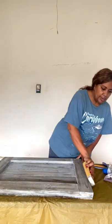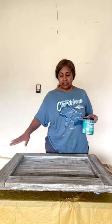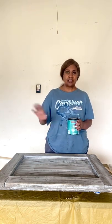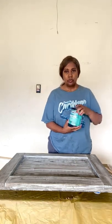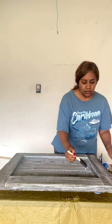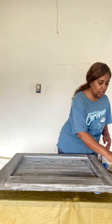The next step: you'll want to apply Minwax water-based Polycrylic to seal in all this goodness. I'll probably put about three coats on it since it is a stove board — you'll be handling it a lot, something might spill, and this way you can just wipe it up. Allow it to dry between each coat. With the Polycrylic, still go with the grain and just put one thin coat, because you're going to come back and do probably two more coats anyway.